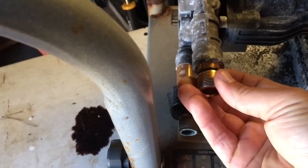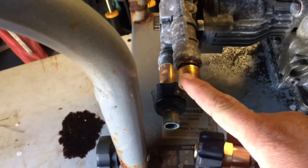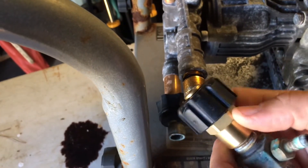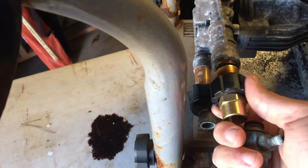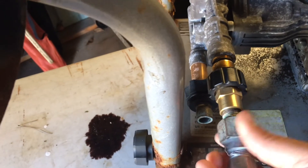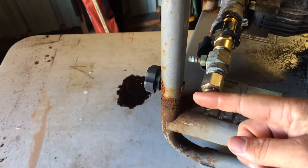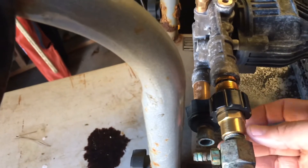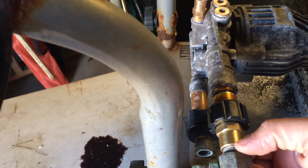I'm going to put this into the pump — it's an 8mm hex head — and tighten it up. This is an M22 fitting, which is standard on these machines. I went to Lowe's and bought an M22 fitting like this, and that's going to go there. Then my downstream injector — which has a plug on it — is going to tighten up and go in here. So instead of being out this far, I've simplified it. That's about the best thing I could find — essentially an M22 to an adapter.